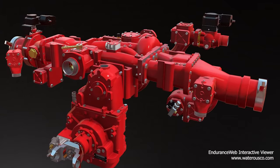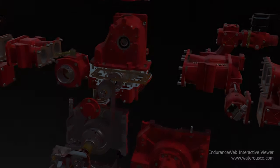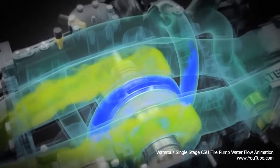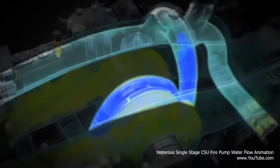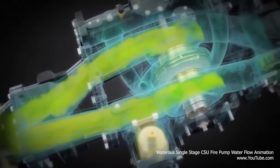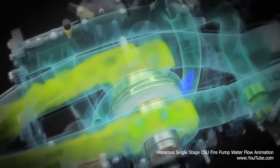So why isn't water on the intake side of the pump pressurized when the pump is engaged? If you look at the design of the pump, you will see that there are technically two sides of the pump: a low pressure side and a high pressure side. In the same way a fan operates, the water on the intake side of the pump flows at a lower pressure until it is drawn into the impeller when in motion.